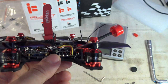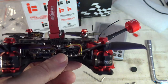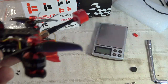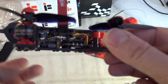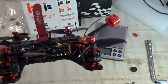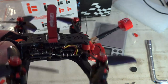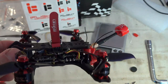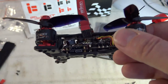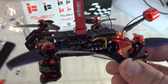And this one is directly soldered on the F4 board, no connector. And the bad news, this one is not flashed with the RSSI friendly firmware. If you want to get it, you will first need to desolder these three wires from the F4 board to another to make your connection to your Taranis radio, whatever. So first bad news, no RSSI for the FrSky XM Plus receiver.